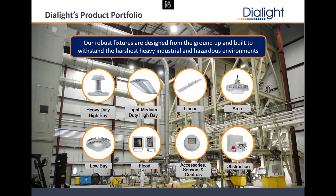We're really known for the hot, dirty, nasty, robust lights. Most of them — like the one we have here, our mainstay — are high bay lights that are all waterproof: NEMA 4X, IP66 out of the box. We can do Class 1 Div 1 and Class 1 Div 2 for all classified applications if needed. That covers almost all the lights: area lights, linears, low bays. The high bay goes up to 72,000 lumens, so up to 100-foot ceiling heights to really light up your facility.